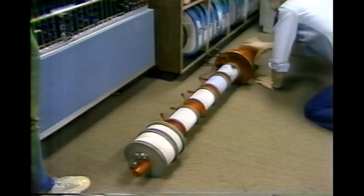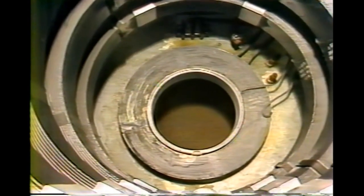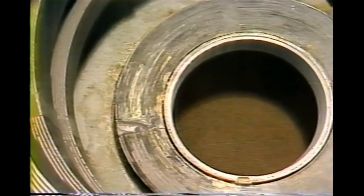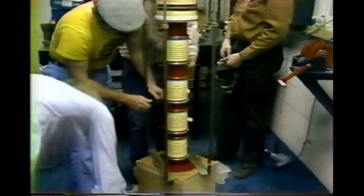When carrying these tubes, be sure that they are supported at at least three points to avoid stress. Looking down inside the empty magnetic frame, we note some signs of water damage on the fifth coil at this time. We can have someone clean these up and re-varnish them if necessary.